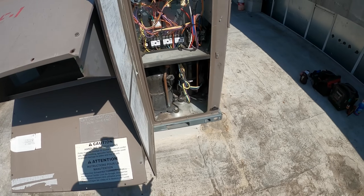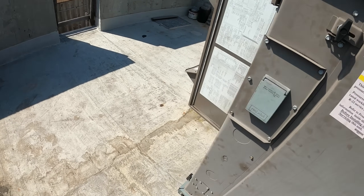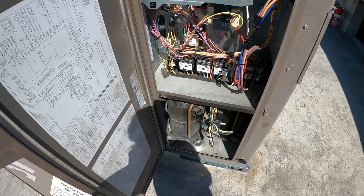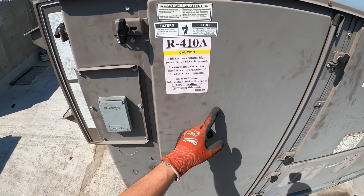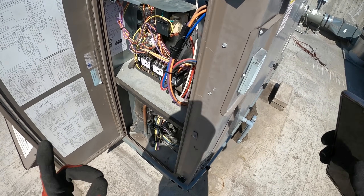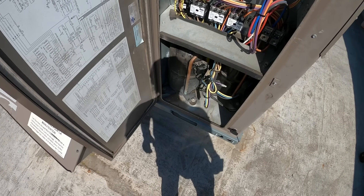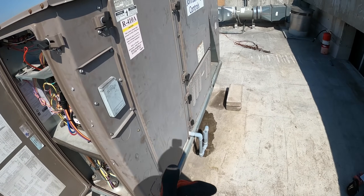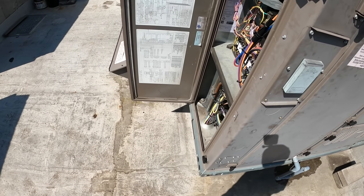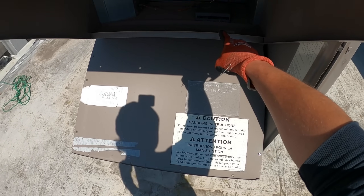To summarize what needs to be done: replace the economizer with the SA bus because that's why we're getting all these sensor issues. The SA bus can't send power. Replace the economizer — it's super rusted in the back. The wire harness is done — those rusted connections, probably got wet. Also we have a leaking circuit two: the condenser coil needs to be replaced, change the filter dryer while we're at it, add new R-410A refrigerant for that circuit, and weigh in the charge. Also, the low pressure switch for circuit two is bypassed and the compressor is disconnected to keep circuit one running.